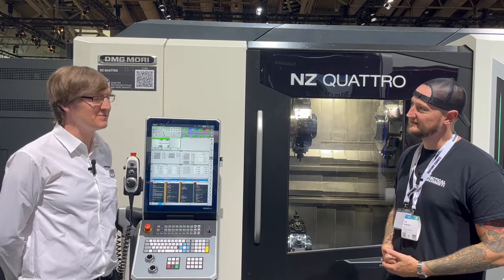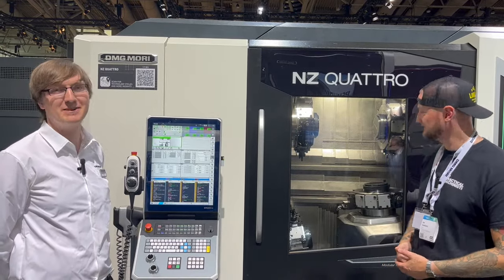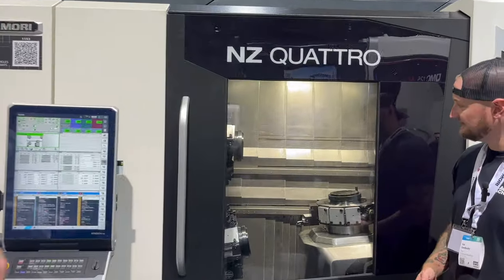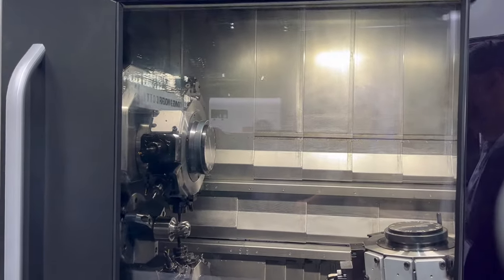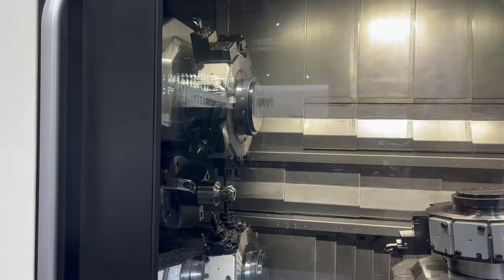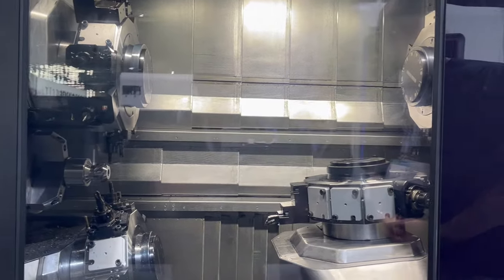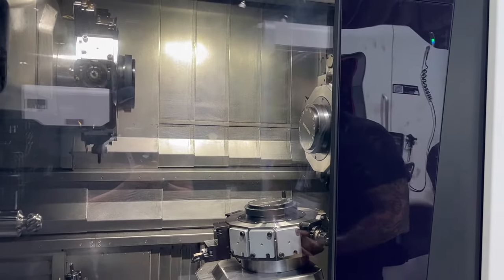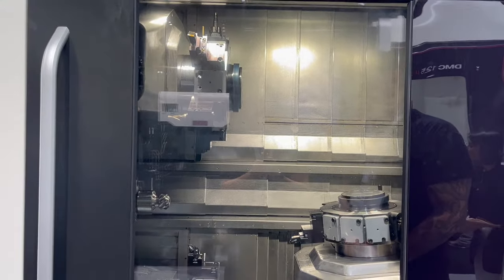The big benefit of this machine is our four-channel — so four turrets can operate on two spindles at the same time. You can see at the machine right now it also has an additional B-axis where we can rotate the turrets to whatever degree you want. So for milling and drilling we have a full functional B-axis. It means it's not only to index an angle — you can completely operate even in 5-axis simultaneous mode.